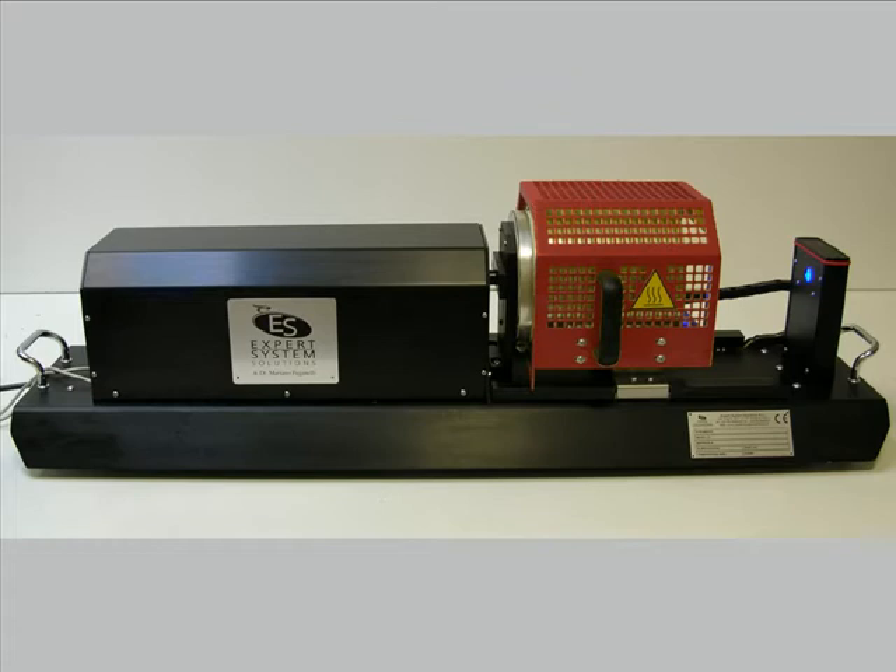The center of the sample bar is focused by a high magnification optic. The sample is 85mm long and it is supported by two holding rods spaced 70mm. A digital camera records all the shifts of the center of the bar, upward and downward. This instrument was conceived to study the flexion phenomena which may be induced by temperature or humidity on material with no application of any external load.